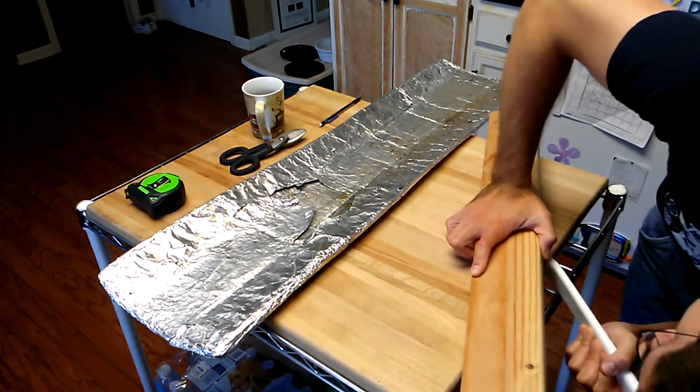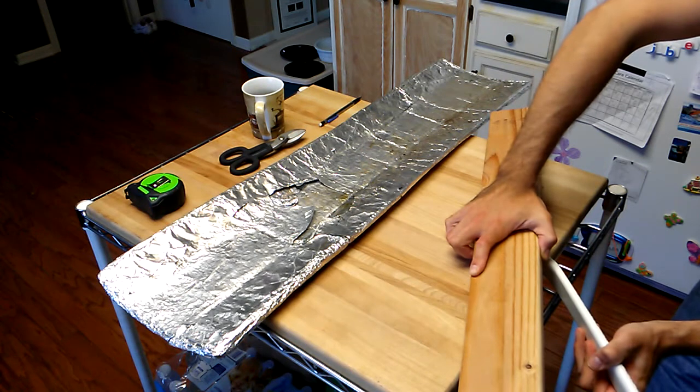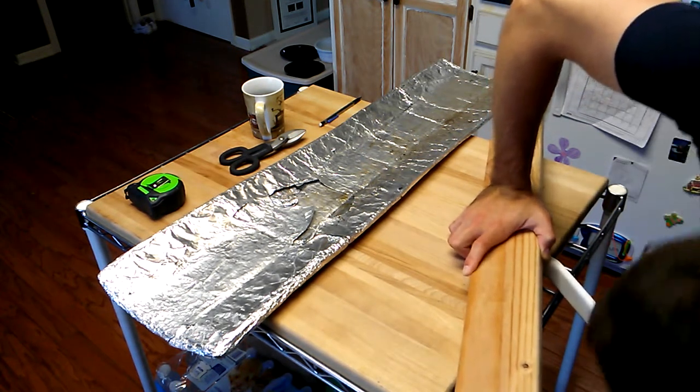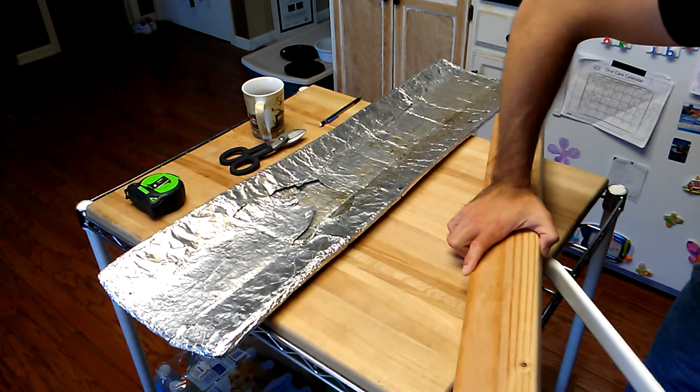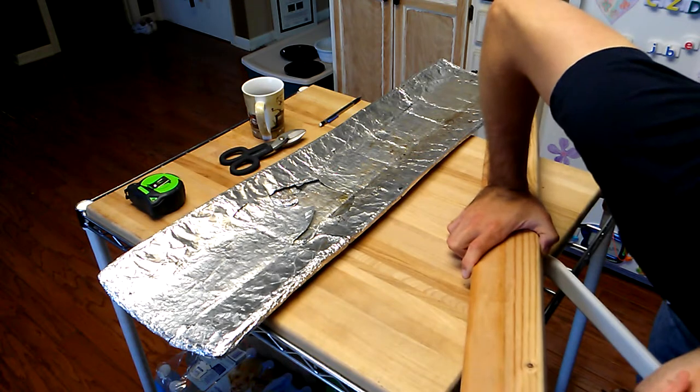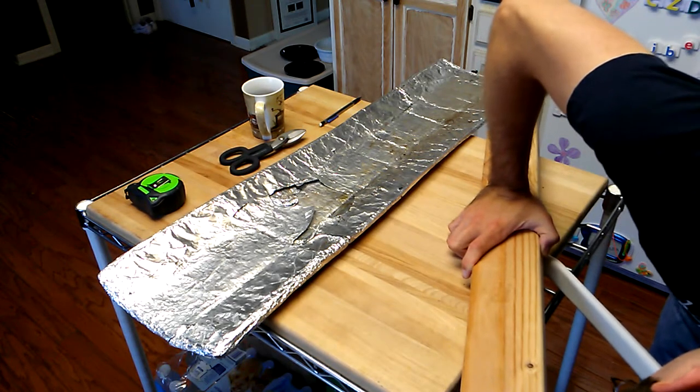And it's going to be a differential taper. That is, I'm not holding the tapering jig here flat. I'm holding it at an angle. Because I want it to be fattest at the bottom, which will also minimize the puffing at the bottom. And it'll be narrowest at the top. It gives a nice graceful taper.